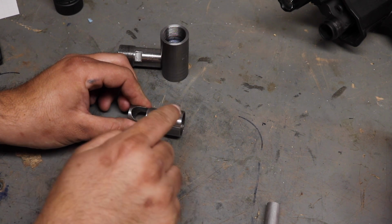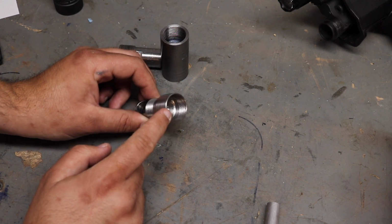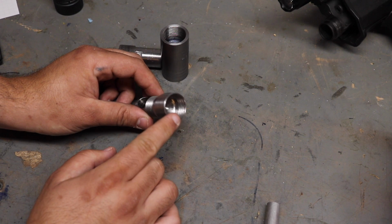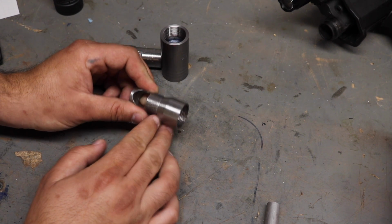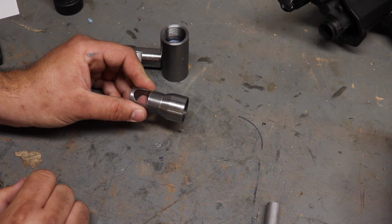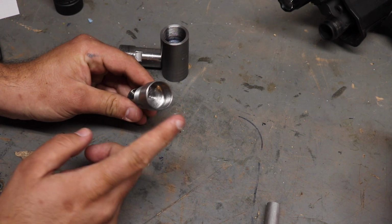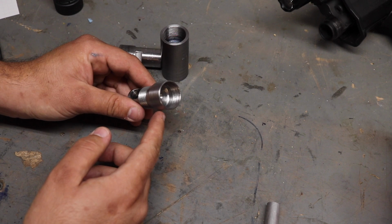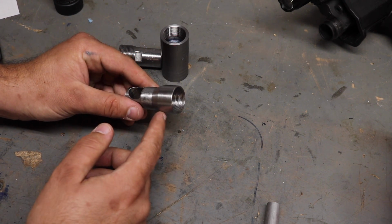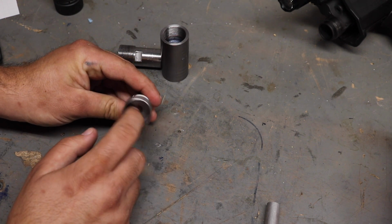So the first thing you notice is this expanded skirt here, and what this is on the inside, pardon the horrendous surface finish and chatter, part of the issues I'm having. This is actually for a 26mm by 1.5 left-hand thread. Post in the comments below if you think you know what that adapts to, what has that threading. But I've got a left-handed internal blind bottom metric thread that I'm trying to cut. And I also need it to reference off this front surface right here.